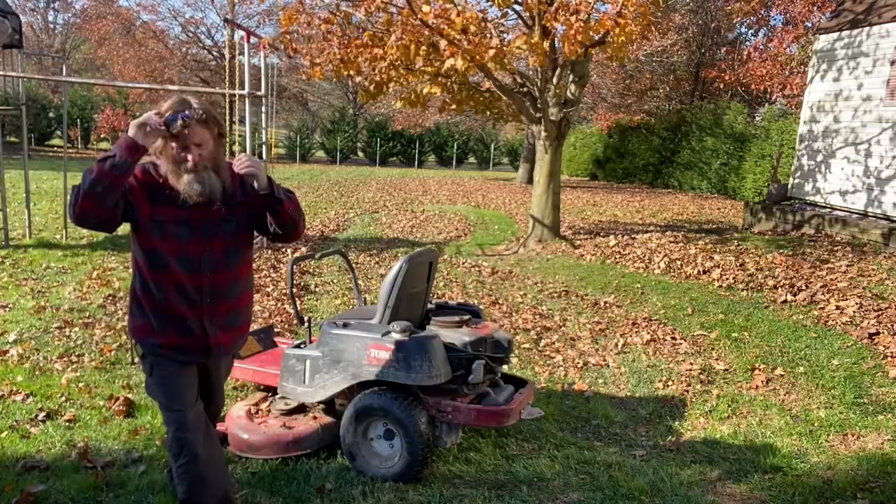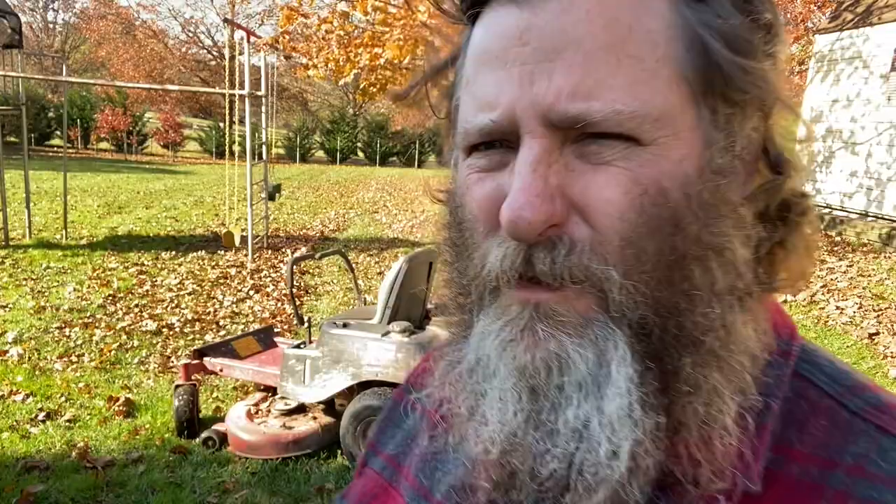So there it is — a quick tip. If you pull your handles in on your mower and it shuts off, it's the little safety switches in either arm. You don't have to bypass all your electronics, wires, and use jumpers — none of that. Just pop those safety switches out, tape them closed, and take your brakes off. You can use your mower until you get your new switches in, and then just put your brakes back on. Little tip.